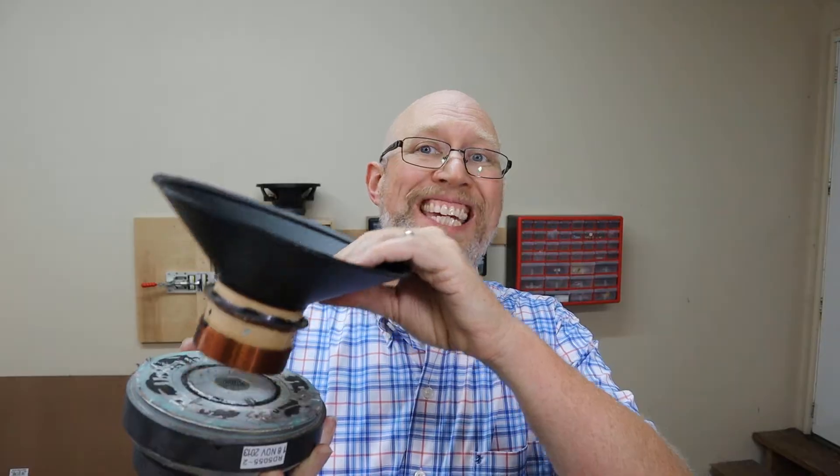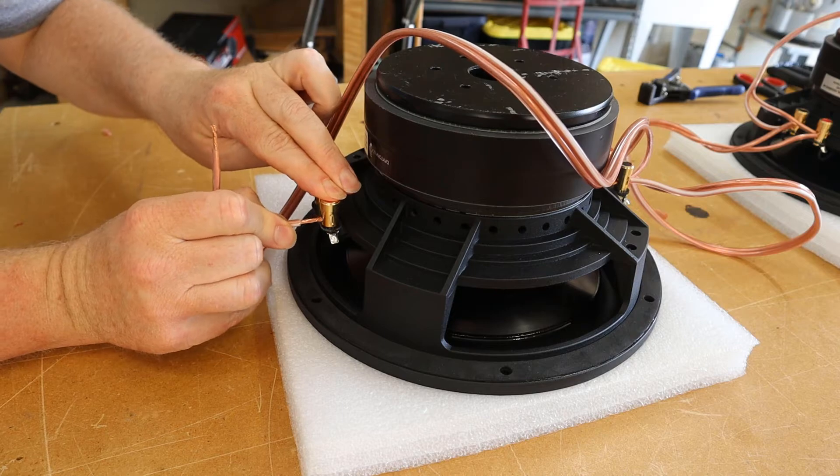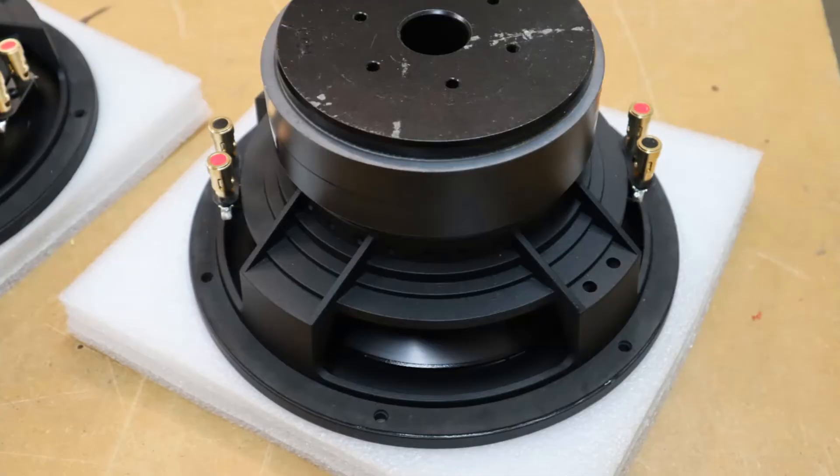When you pass a current through the coil, it generates a magnetic field that pushes the coil against the magnet — it's basically an electromagnet. If you have two voice coils, we call it a dual voice coil subwoofer, and having two voice coils gives you more options for wiring your subwoofers. A dual voice coil subwoofer will have two voice coils wrapped together around the voice coil former, and two connections for the tinsel leads, and thus two speaker terminals on the woofer.